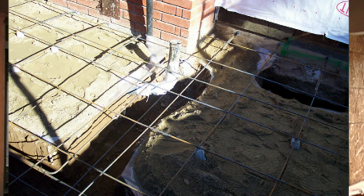If you really want a good foundation, use the rebar — a little bit more of a challenge when you're pouring it. Use the 6x6 wire mesh for a middle option, and if you don't really care or it's going to be a real small patio, you could just use concrete without any reinforcement. But if you want a nice slab, rebar at 16 or 24 inches on center will give you a good product.